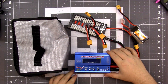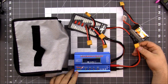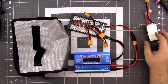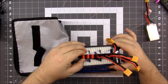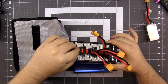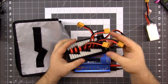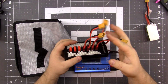At the time I just thought I could charge one battery with it because it came with basically an XT60 connector and a couple other connectors. Then I found out about balance chargers, so I picked one up — and I bought the wrong one. This one has Dean's connectors, so hopefully this saves you guys the trouble of having to buy Dean's to XT60 converters.